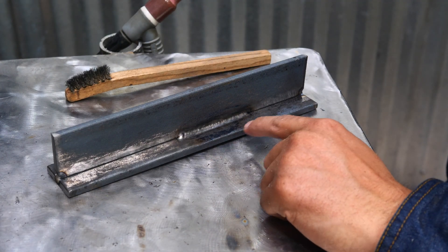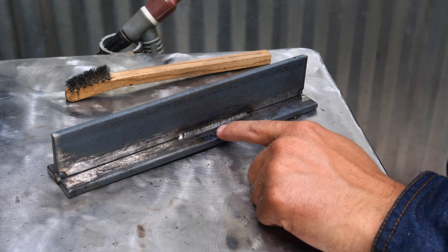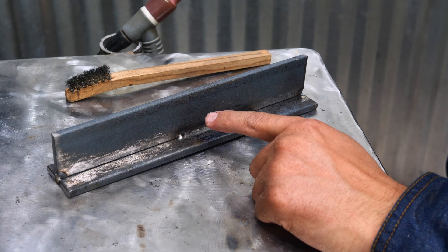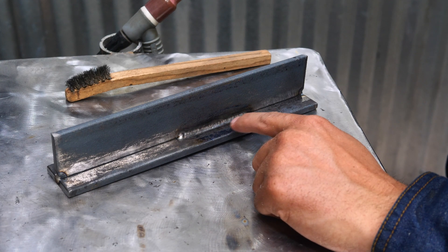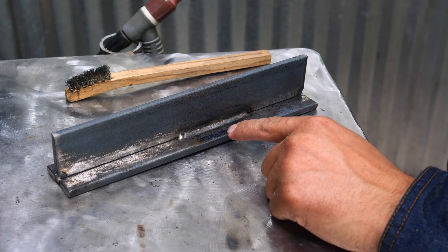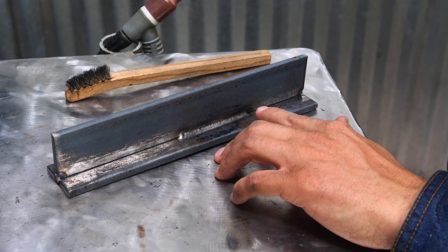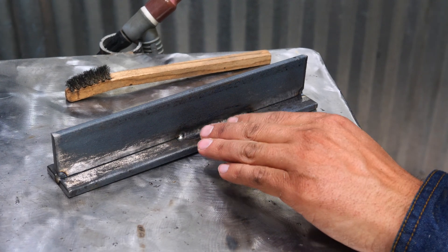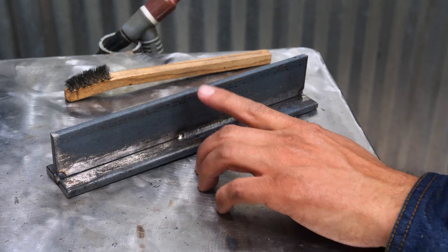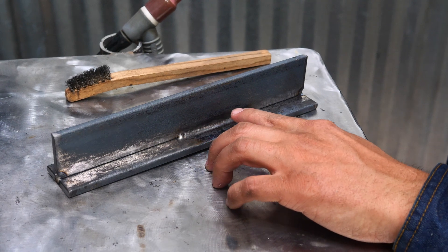This is the inside corner joint on quarter inch plate but without enough throat. The legs of this weld are about an eighth of an inch, but the throat is probably only about a 32nd of an inch — it's really, really thin. Something to note: there is a hairline crack down the face of the weld right in the middle. This is really common with welds that don't have enough throat — they don't have enough strength to resist cracking when the metal starts pulling and warping. Welding always causes distortion, and in this case the material moved and caused a centerline crack.